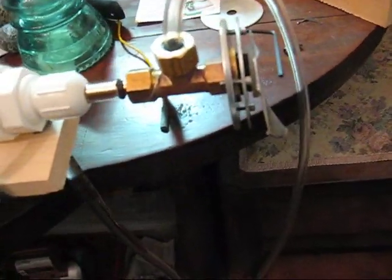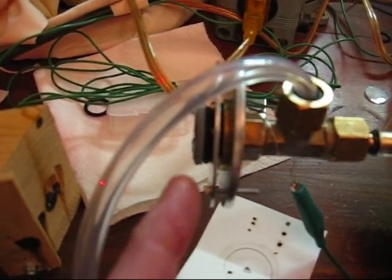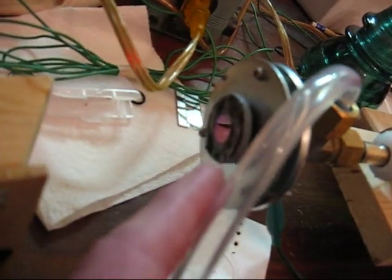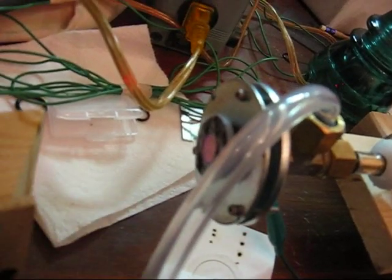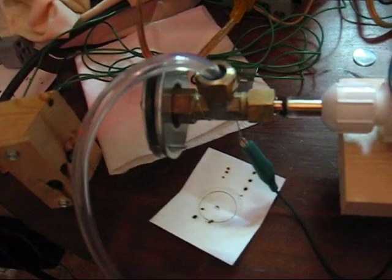Here's the high reflector. It's literally the air pressure from the atmosphere holding it on when I turn the vacuum pump on. The O-ring adjustment is here in the middle. On the end, the output coupler and the high reflector are just held on by another O-ring and using the atmospheric pressure to press them up against there and seal at the same time.